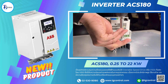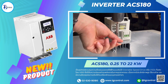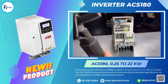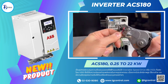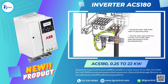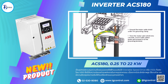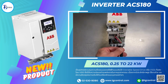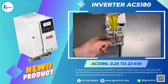Install the grounding plate and fasten it with the provided screws. Prepare the motor cable conductors. Ground the motor cable shield under the grounding clamp. Twist the motor cable shield into a bundle, mark it with yellow-green tape, and connect it to the grounding terminal. Connect the phase conductors of the motor cable to the T1-T2-T3 U-V-W motor terminals. Torque the terminals to 0.8 Nm.